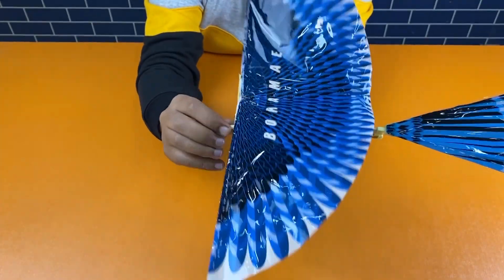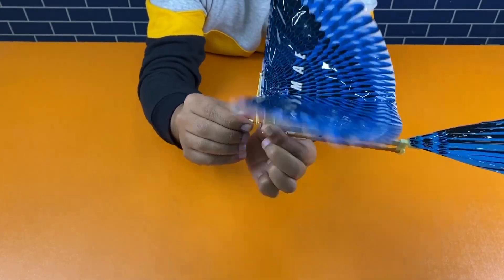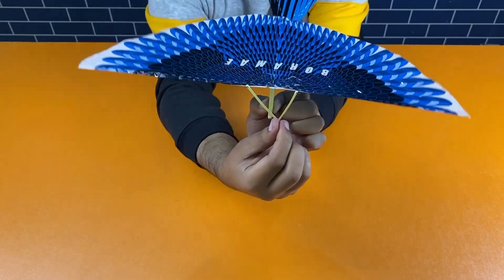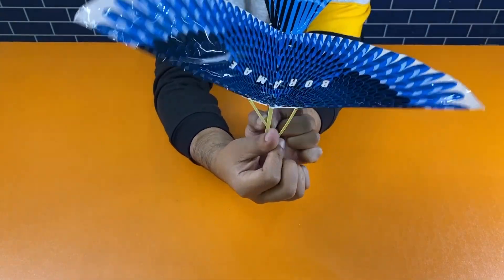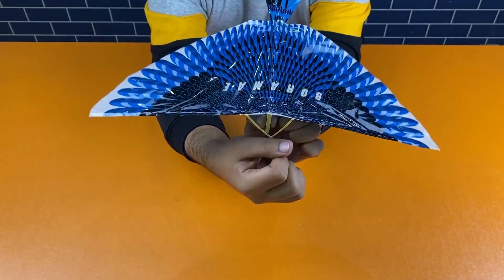The rubber band has a mass of 1.09 grams. This puts the specific energy at 1651 joules per kilogram for stretching and 6605 joules per kilogram for twisting. This stretch due to rotation rotates the axle.